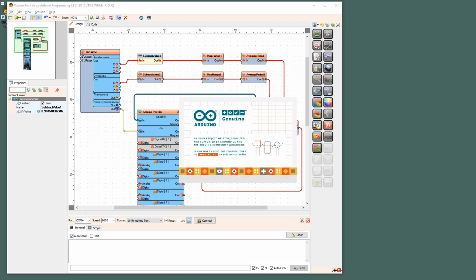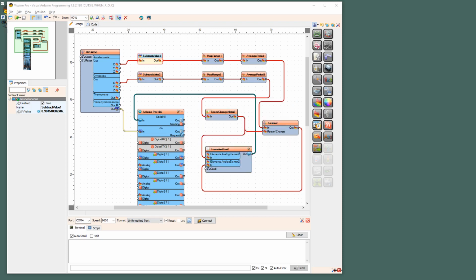Now one thing about this that is kind of neat is you can set the GForce. So you've got 2, 4, 8, and 16G. 16G being the least sensitive. So it's 16 times the force of gravity per point, if you want to think of it that way. Versus 2 times the gravity to each point. You're getting 16, so you're way less sensitive.